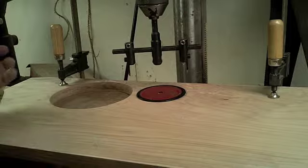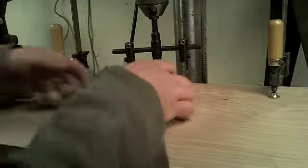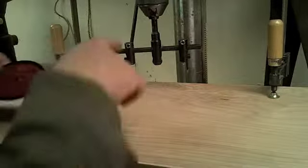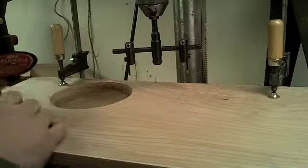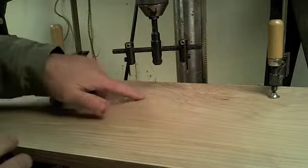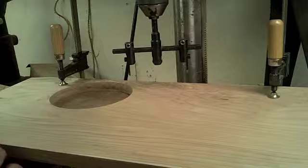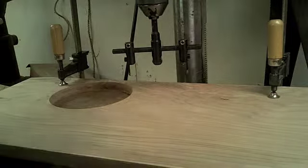Making the platter or coaster holder for my recycled record coasters, I'm going to use the big fly cutter here, set to a pleasing oversize, and mine is oversized by about half an inch. I've picked a really nice piece of figured maple, which should give me an attractive look. When I went to set the cutter, I was careful